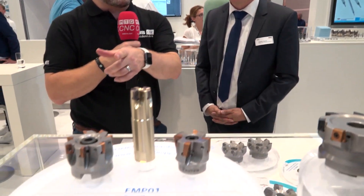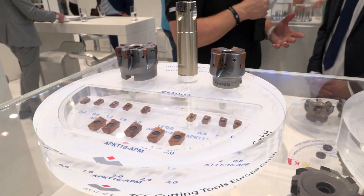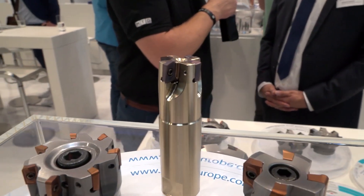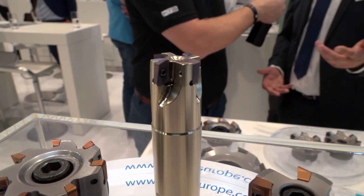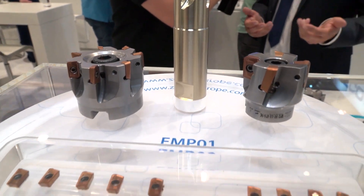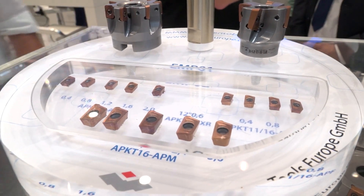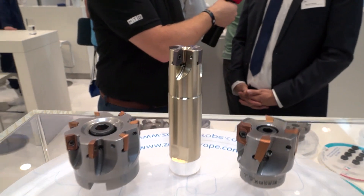And the next one, it's probably my favorite — it's very simple but it's clever. So you've got a 90-degree cutter body for 90-degree milling, and you've put a high-feed insert in that same body. Yeah. Here is also the big advantage — you don't have to buy an additional body for that. You change only the inserts, and you can run with one series in two different styles: square shoulder milling and high-feed cutters. And down to 60 millimeters, so that's really a big advantage.